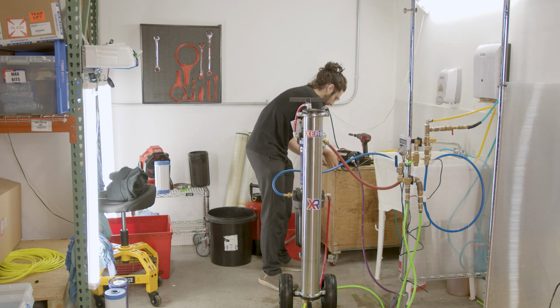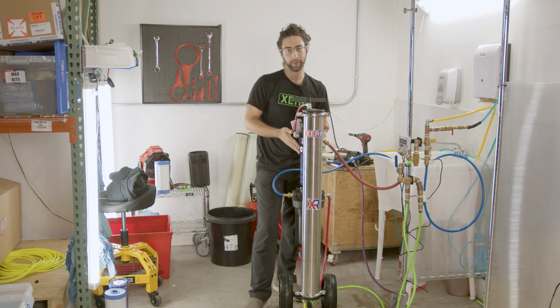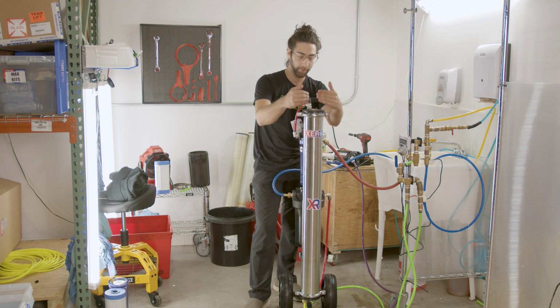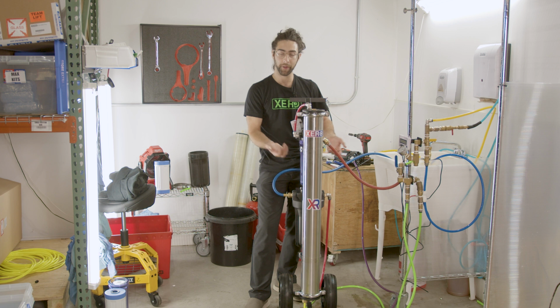So first and foremost, the carbon filter. The carbon filter is something you're going to be changing more frequently than any other filter in this system. It's not the first thing to save TDS, but it's to prevent TDS. And I say that because you want the filter inside the metal housing to last the longest. So, start by changing your carbon filter.